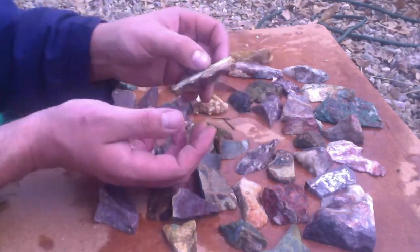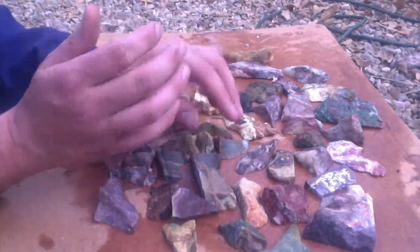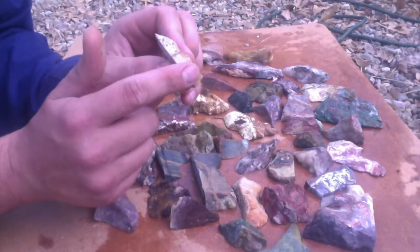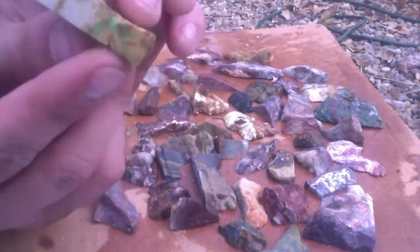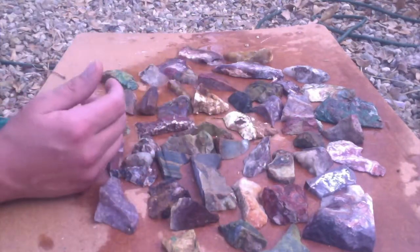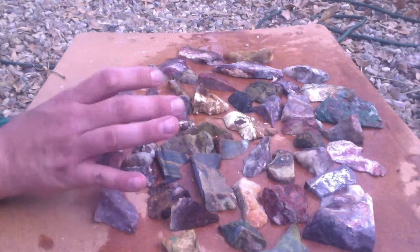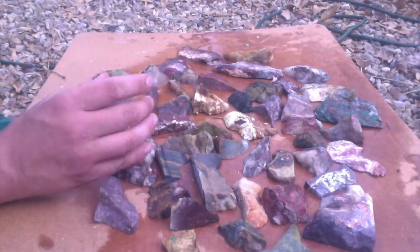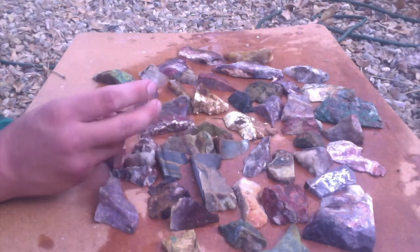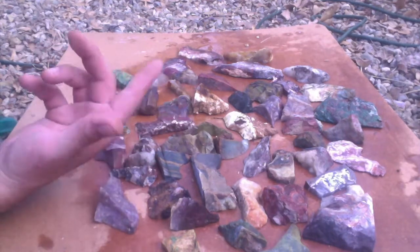First, I will be grinding with 60 grit to remove all of the saw marks. Then with 80 grit to further remove saw marks and also to remove anything that broke while being sawed and left little nubs at the end. From the 80 grit, I go to 180, I believe, all of which are hard wheels on the Flatlap. From 180, I go to 220 on the hard Flatlap. From 220, I then go to sponge pad, soft silicon carbide wheels on the Flatlap.